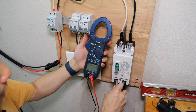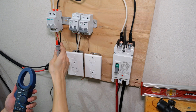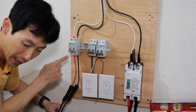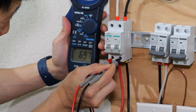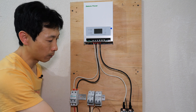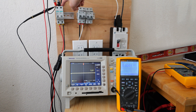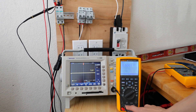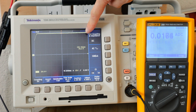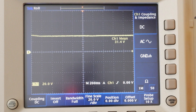25.69. So the black is negative. Battery minus over there — good. This is solar negative — good. I have the 50 foot solar cables I made hooked up. We can now double check the voltage right here and make sure we have the correct polarity. Negative is black, it says 69 volts. So we're good to go. Turn on the battery over here and it should turn on. Look at that. I'm probing the solar panel voltage here. I have this meter hooked up in series to measure the current of the solar panels. I'm going to flip the switch on and we see the voltage goes up to 78 volts, and then it slowly ramps it down. Right there — and that's the MPPT.